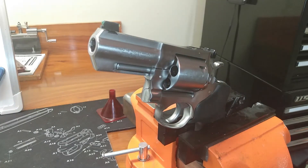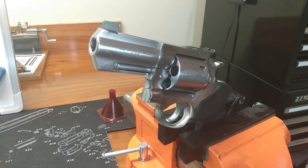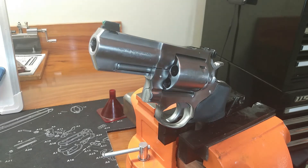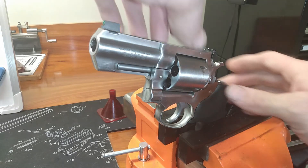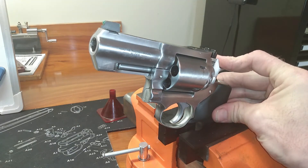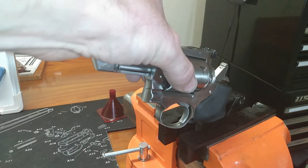On the topic of how well my cylinder is aligned to my barrel — sometimes not so much — and we really depend on a good forcing cone to help in those situations. But there is something I notice a lot of revolver guys struggling to understand, and that is the side-to-side play in their cylinder. I'm going to show you here first — the gun is unloaded — I am about to fool with the trigger. When I pull this hammer back, I note I've got this play here.